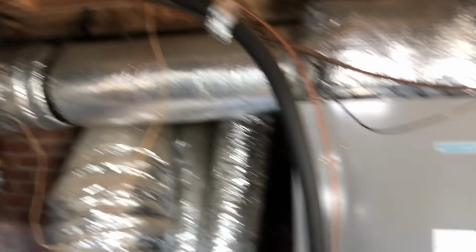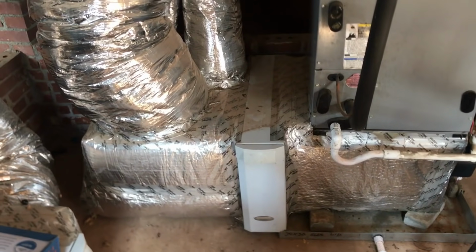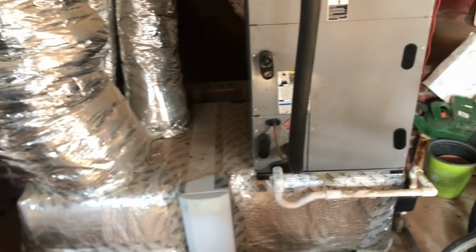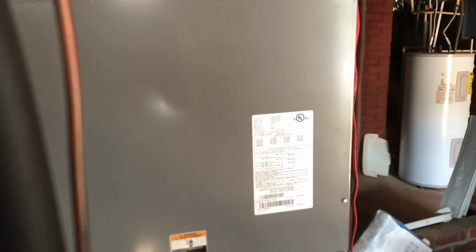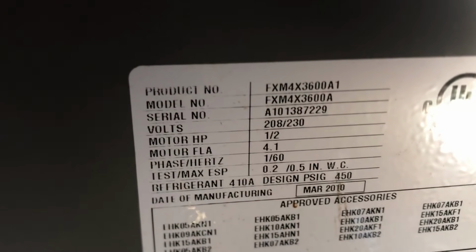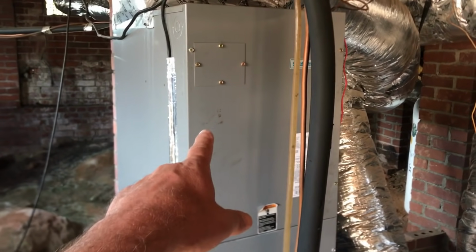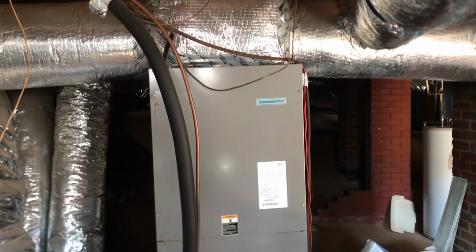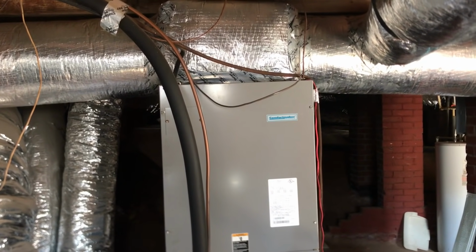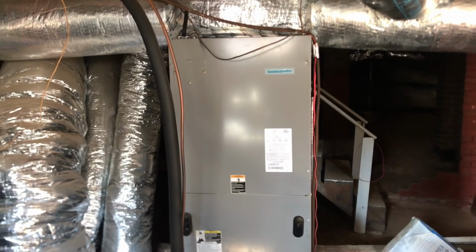We just did a kind of a mild duct job, and we used to use these April Air filters before we started with the ones we've got now, and we've had really good luck out of these air handlers here and out of these Comfortmaker ICP pieces of equipment. Done us pretty well. This one failed after about 8 or 9 years, and it's been another year or two, and now this one has failed. So as the X-13 and ECM motors go, that's actually a pretty good record. An awful lot of them failed in 1 or 2 years and still do.